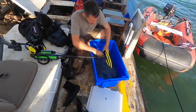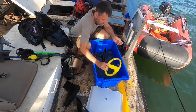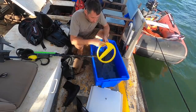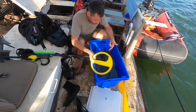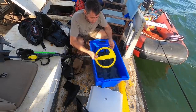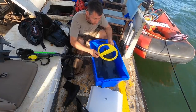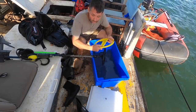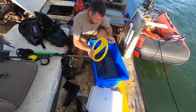With these Excaliburs it's actually important to get this coil protector skid plate off because you can get a lot of that mineralized sand in here and get false readings. Nick bought one second hand that apparently was giving a lot of false readings — he got it relatively cheap. When it arrived he saw that this had been cable-tied on, so the first thing to do is cut those, take it off, clean it and it works perfectly. Definitely the most important thing to clean for results — don't skip this.